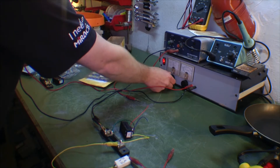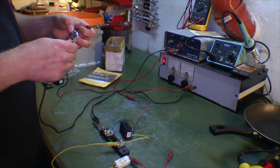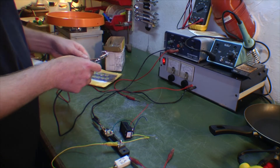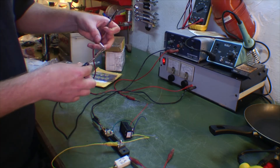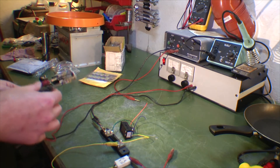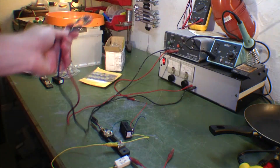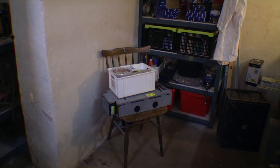I'm gonna make sure it's 12 volts and reduce the power a little. These are 10 watts, so about an amp of power should be okay. Let's set the multimeter to 800 milliamps. There's no cooling on this, so I'm not gonna fire it up very long. This is like one diode — it lights up the place pretty good. Pretty dark over here because I'm not filming there, so I'm gonna turn it off again before I damage it.